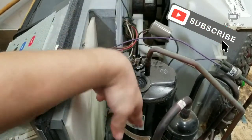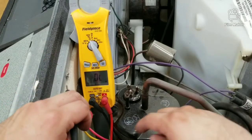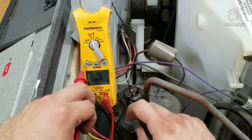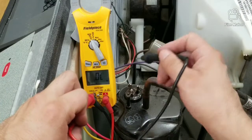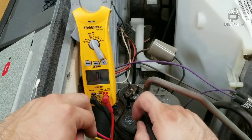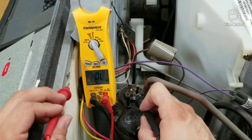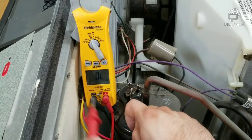We're going to find out if that's the case with this unit. We've got our three terminals: start, run, and common. You can see those marked with the little gasket that comes from the compressor, but we're not going to worry about that right now. We're just going to test every single one of them. I put my voltmeter on continuity — that's how I check for ground in this compressor. We're going to start by checking one at a time.